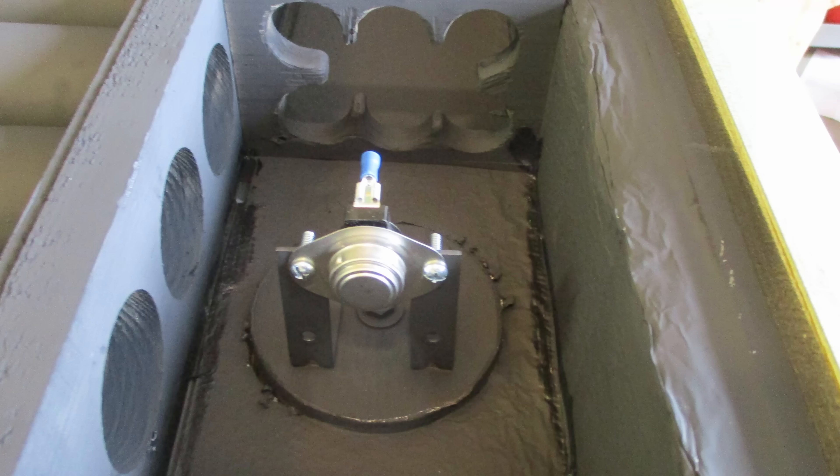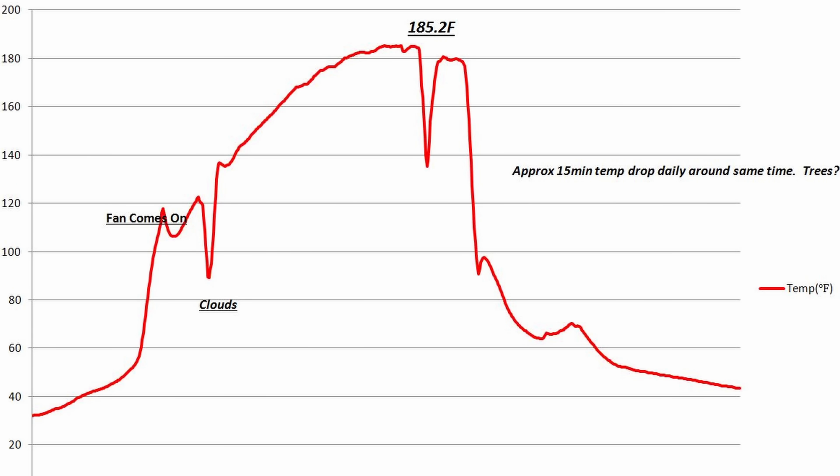You'll need a little bracing in the middle of the cans because they tend to flex when laying flat. Then mount your top header onto the cans, glue them in, and fix it into the box. Insulate above and below, and paint everything with high-temperature flat black paint. For the holes, I used 4-inch but I'd recommend 6-inch — one at the bottom and one at the top. You'll also want a snap switch if you're using a fan: I used an 85-to-110-degree snap switch that kicks a circuit at 110°F to turn on a fan to draw more air through, and shuts off at 85°F when the heater is cooling down.